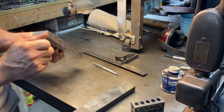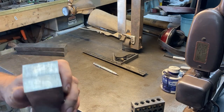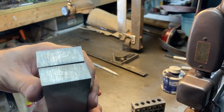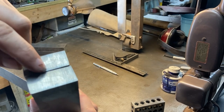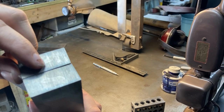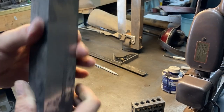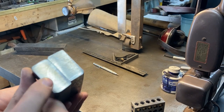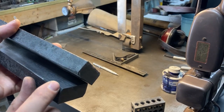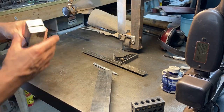These two are from one bar — the ends that were near the middle. They're the same as each other because they were cut apart. Check that out: that's an acceptable result — a pronounced S-shape with a pretty horizontal middle section. It's got enough room for us to split it, although not a lot of room for error. Not ideal, but it'll work. We're going to split each one of these down the middle and separate the S into two corners. The other ends look much milder — this wouldn't work if it was like this through the whole bar, but fortunately it's tapering off toward the end.